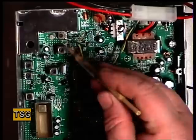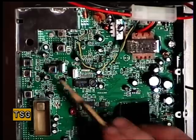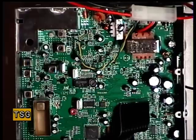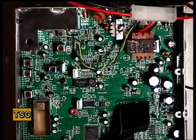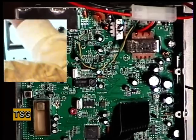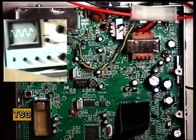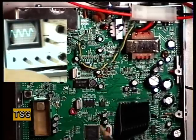Just to recap: you've got 501, 503, and L504. And now we're just going to do the detector, which is 505. So we'll set the signal generator for 100 microvolts. I'll just put the other camera back on. We'll keep the left hand oscilloscope this time. Better just move the light out of the way, not in the path of the other camera. And adjust 505.